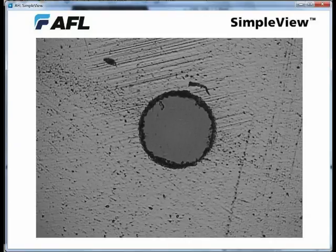This is why we always suggest inspecting all patch cords. And of course, whenever you take a patch cord out of its packaging, it has a dust cap on the connector. We always say inspect connectors and clean them after you take the dust cap off, because there's a reason they call it a dust cap — it's usually full of dust.